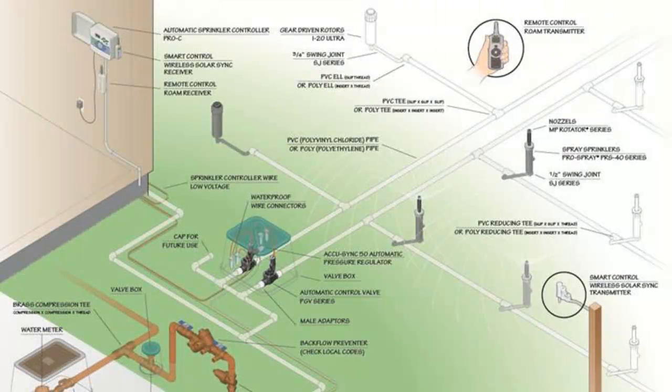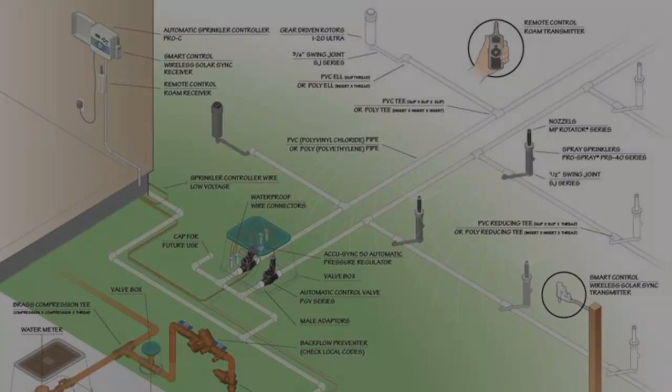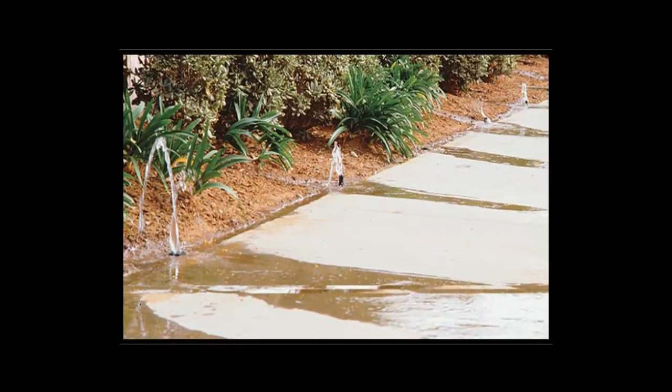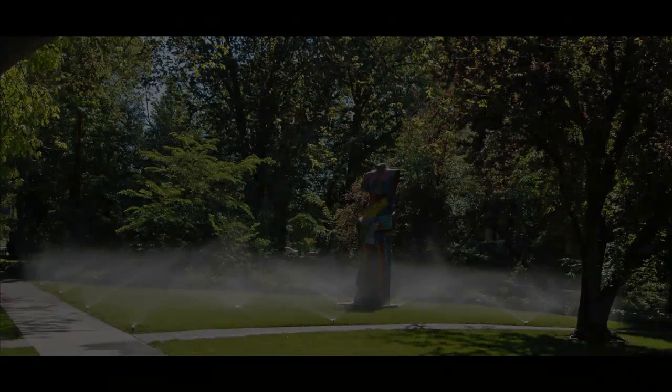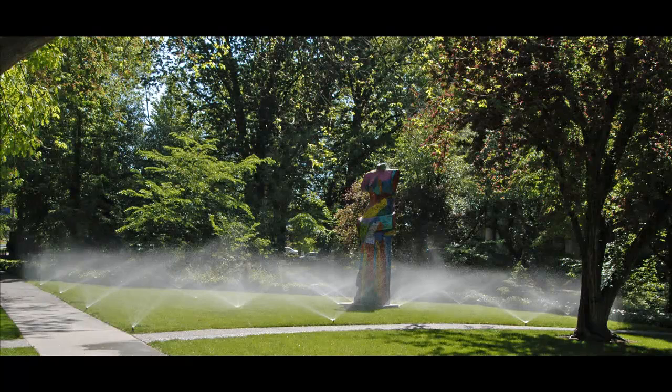An irrigation system includes a pipe network which can hold a large volume of water. If there is a slope to the landscape, some of this water can drain out of heads that are at low points of the system. Often people think they have a leaky valve when they see water oozing out of a sprinkler after the system runs, but chances are it is low head drainage.